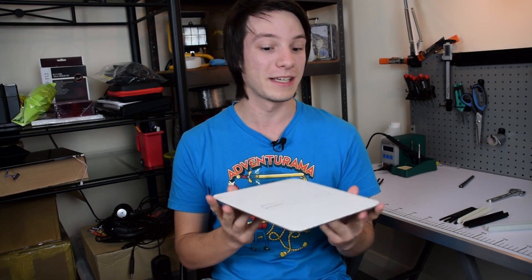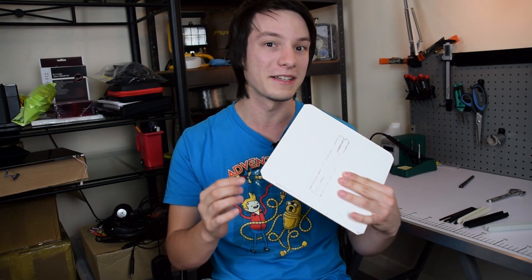That's the biggest contradiction with FDM 3D printing, especially when printing with high-warp materials like ABS — you want it to stick down during the print, but after the print's done you want to be able to get it off. Glass is the biggest issue there: you might get awesome adhesion but you can't flex the glass plate. The Zebra Plate solves that. In terms of construction, it has a composite middle section with two proprietary thermoplastic coatings — both the same, just different colours, so you can flip it either way — and two thin copper layers which help for inductive probe sensing.